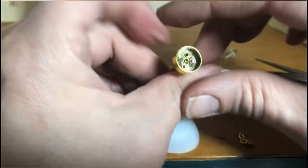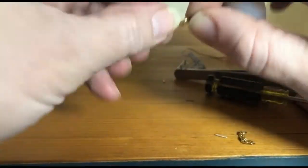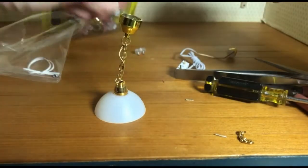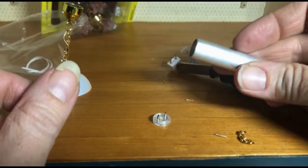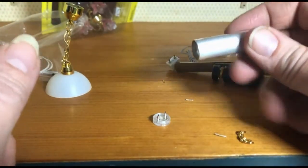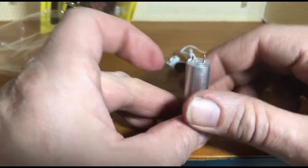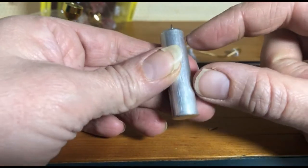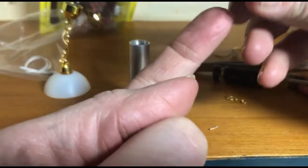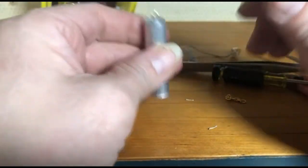We have the actual adapter connected to the light. There's a little extra wire here — I can push that up in there and twist it so it doesn't show as much. Now to attach it to the ceiling, the second part that comes with the kit is the disc. They don't sell these any longer but we still have a few in the store. If you don't have a tool like this, you can easily use a chunk of strip wood — half by half or even quarter by quarter, about an inch long — stick a little wax to it. You just need something to hammer against.